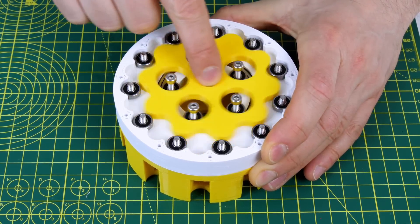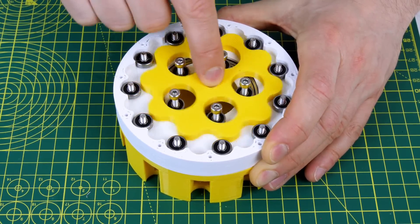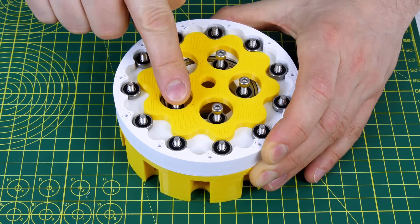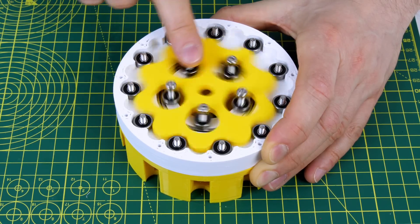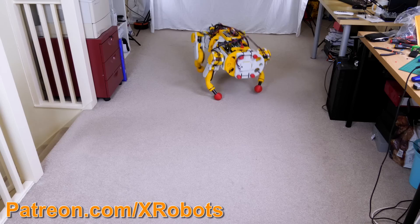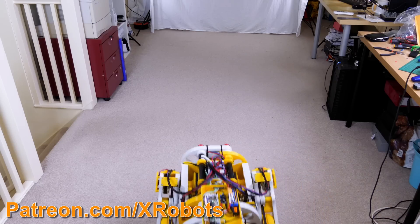In part one of developing a cycloidal drive, I made a cycloidal drive reducer. Essentially it uses a cycloidal disc which wobbles — a bit like a ring gear with a smaller gear inside doing a reduction. My five pegs are the output. I'm really looking for something that can be back driven, so we can use it for dynamic robots like robot dogs that rely on a low reduction ratio of less than 10 to 1.